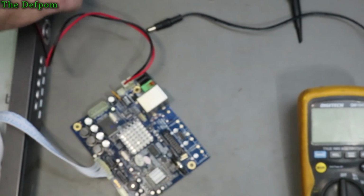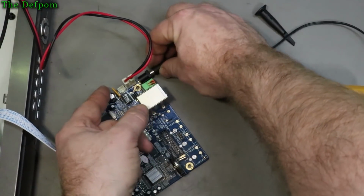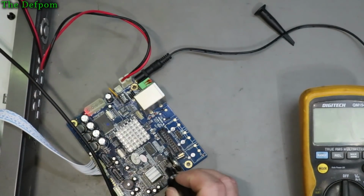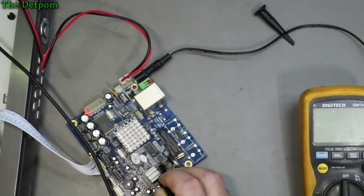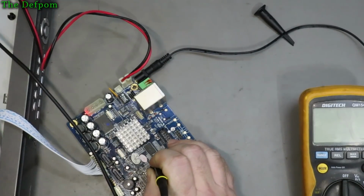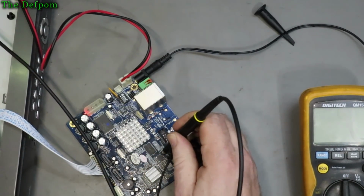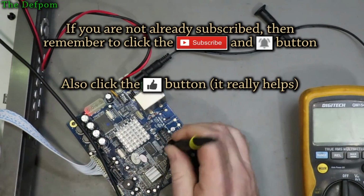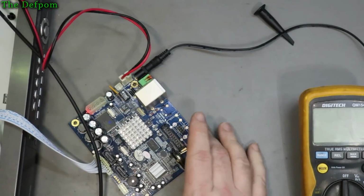Right. Let's get the probe and plug power in. That was always helpful as well. Check that oscillator, see if there's anything on that. So I've got some voltage on that. There's a signal there. Can't see what it is, but there's a signal. Let's have a look. That says 54 megahertz right there. Just check the other pins. Nothing on that one, it's probably ground. Now on there is voltage, 3.3 volts. So I think that the 54 megahertz is correct. Oh dear, that's another option gone.